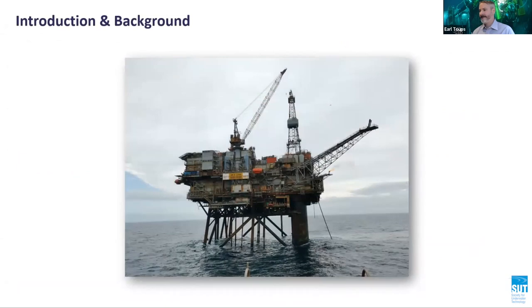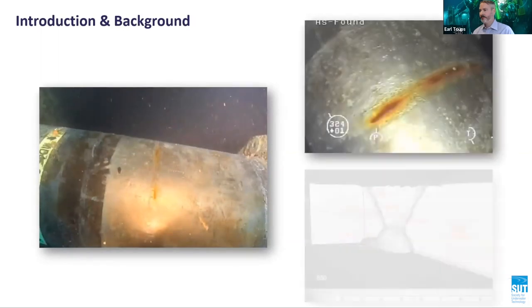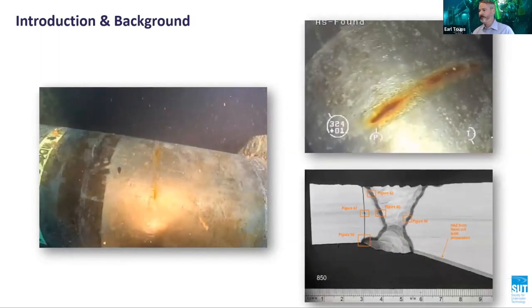Ever-maturing North Sea jackets, coupled with a combination of high fatigue stresses, fabrication defects, high utilization, and a low redundancy design, eventually result in fatigue cracking. High sea states often experienced offshore can further exacerbate the problem, and if not closely monitored, fatigue cracks can propagate through thickness and around the circumference of the brace relatively quickly, ultimately leading to brace severance.